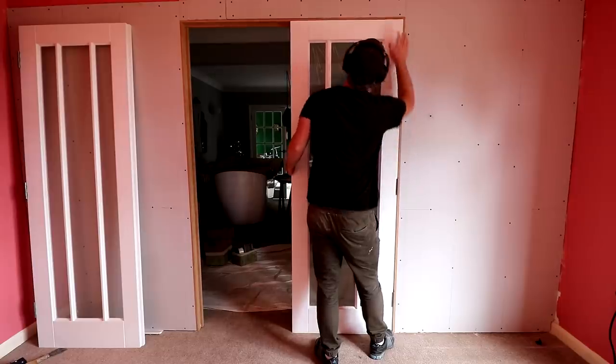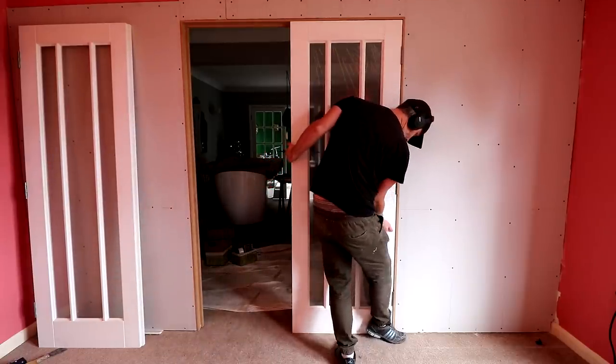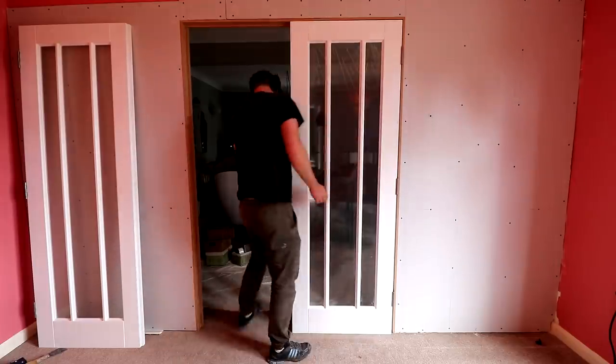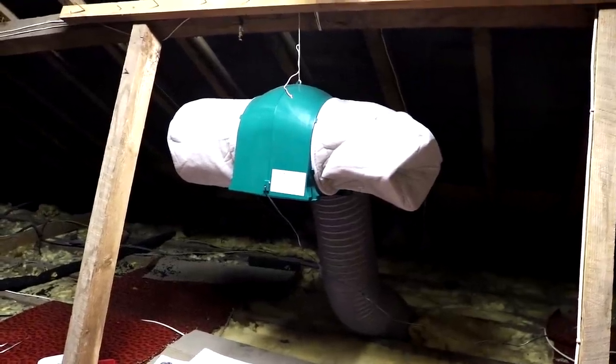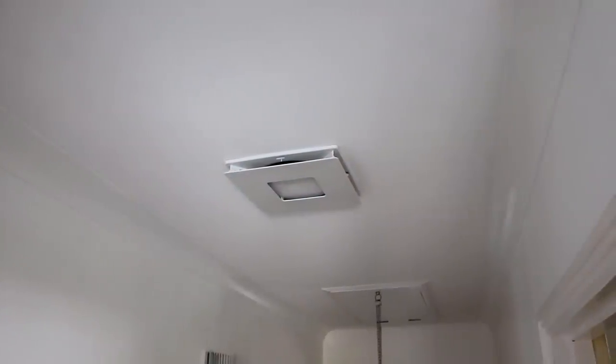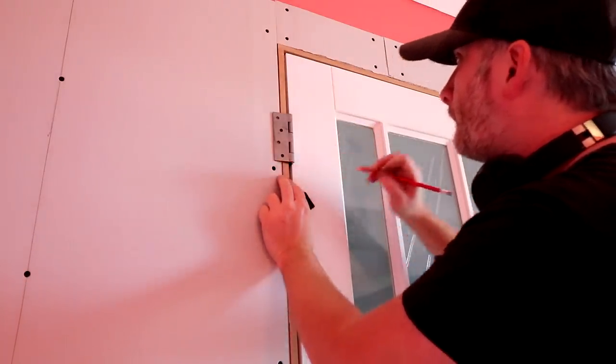Then I just offered up the doors to see how close they were looking — the height looked good. I knew I'd need to remove some from the bottom anyway; I actually want at least a 10mm gap at the bottom mainly for airflow, as bungalows are quite prone to condensation and mould. That was a problem when we moved in last year so we got a PIV system fitted in our loft which pumps fresh air through the property, and it's important to have gaps under all the doors to let the air circulate. That PIV system works brilliantly — if anyone is considering getting one, do it. Not a sponsor or anything, but it's completely resolved our issues.